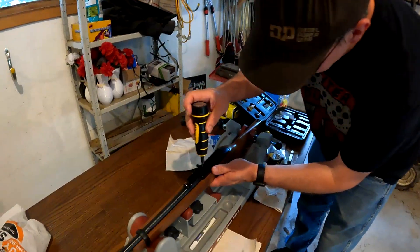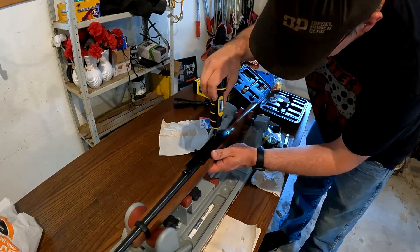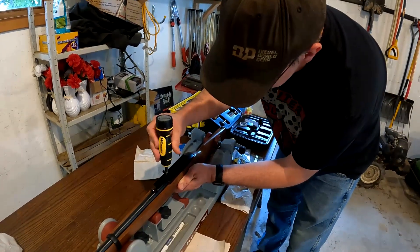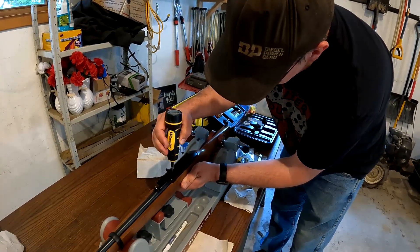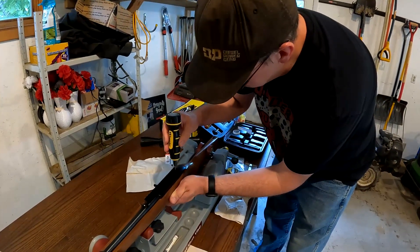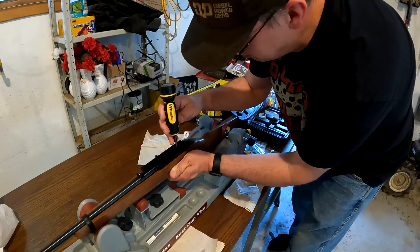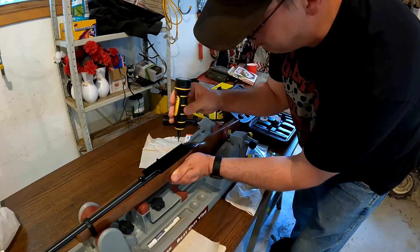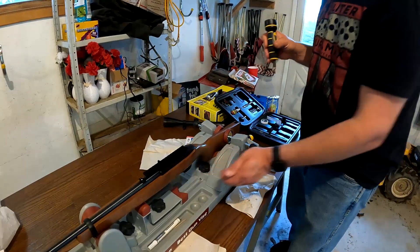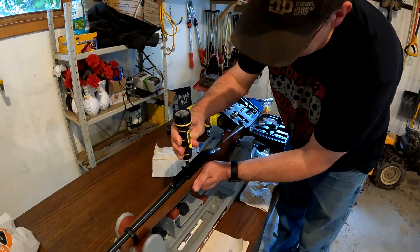You're also supposed to torque them a little bit at a time and work them down — don't go for 15 all at once, same principle as torquing an engine head. If you tighten one down it might loosen the next one. Torquing each one to 15 inch-pounds, you can hear it click. Now we should check them once more in case one loosened when another got torqued down. She's good to go.